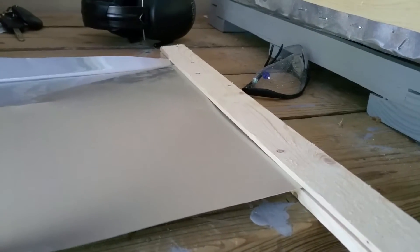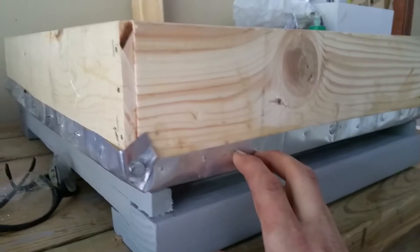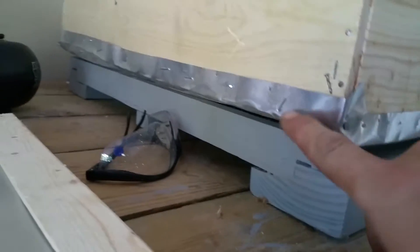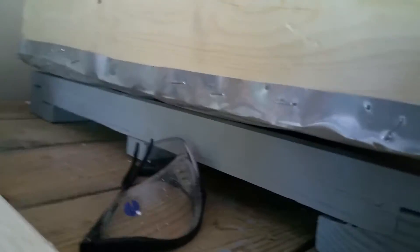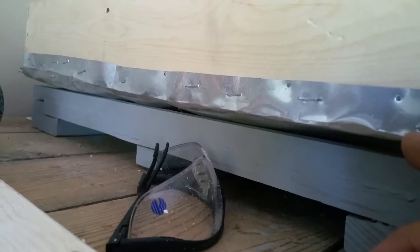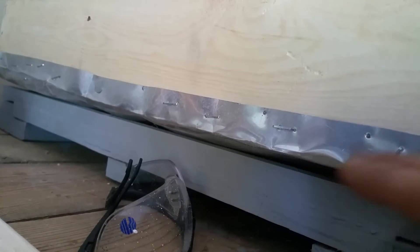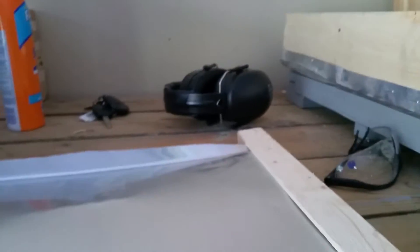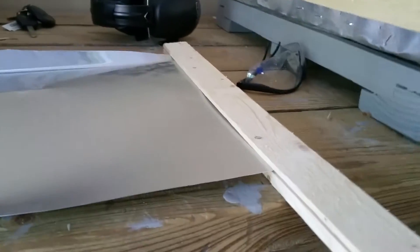This is my bee guy coming at you with a tip for today. It comes in making the telescoping lid for a beehive. The challenge is with this metal flashing here and getting this bend nice and straight. I used metal clamp pliers — eight inch pliers — to try to make my bends, but it leaves a dimple every few inches where it clamps. So a gentleman on our Facebook group showed me what a metal brake is.